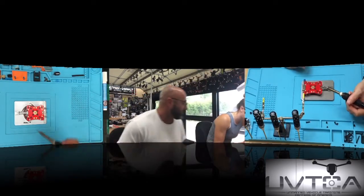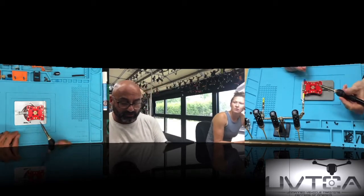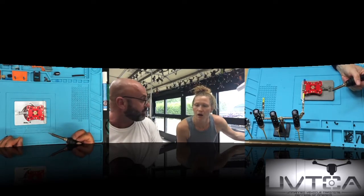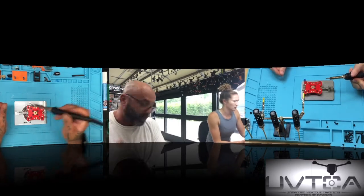Excellent. I got out of the copper though. No, you're not out of the copper. You're perfectly fine. Okay. Don't worry about it. Okay, so now watch this one, okay? Watch me do this one next. Ready? I'm just gonna put it here, and I'm just gonna color it real quick, and there you go, you're done. Okay. Look, the hotter part of your iron is the side of the tip, not the tip itself.